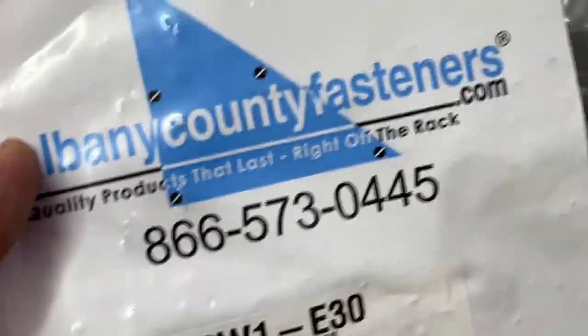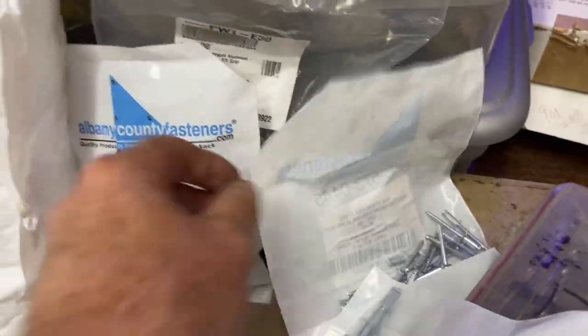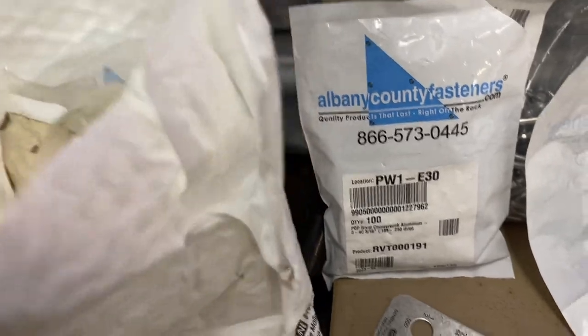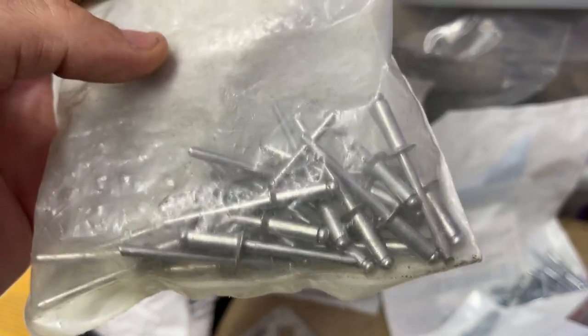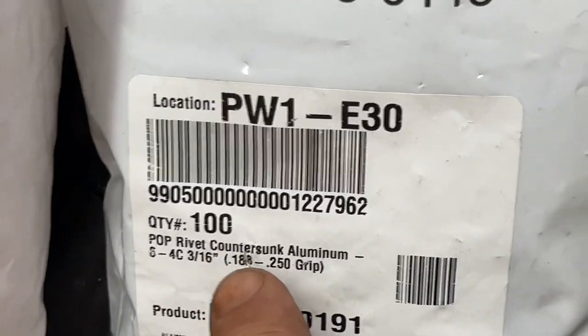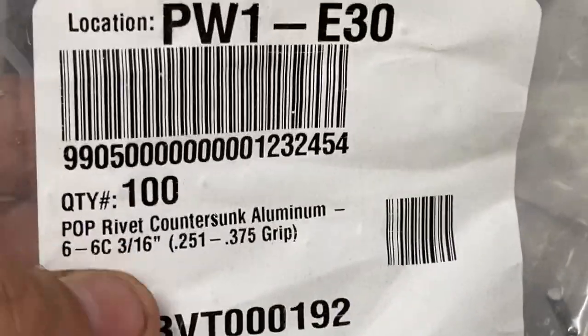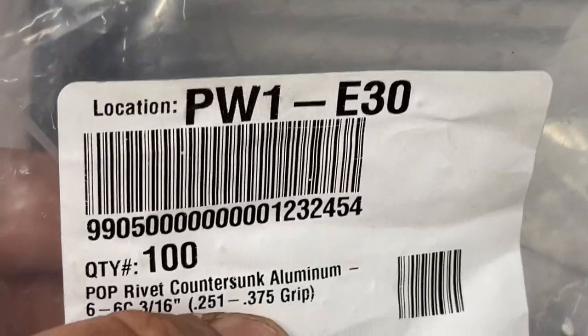And you can go to albanycountyfasteners.com. This is not sponsored by them, but I have bought rivets from them several times before. In fact, here was the pack that was getting low that spurred me on to order some more. You can get countersunk head rivets. In case you weren't aware, the 6-4C is the shorter of the two. The 6-6C is the longer of the two. 3/16, .251 to .375 grip.